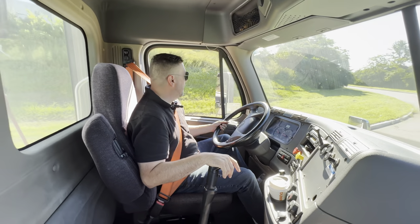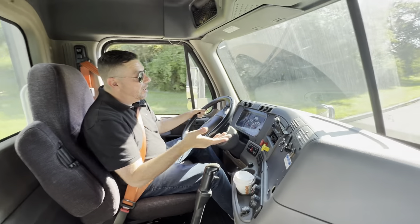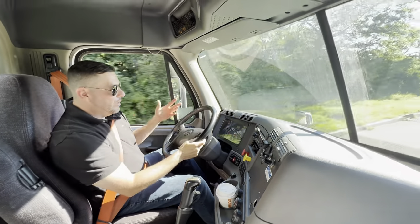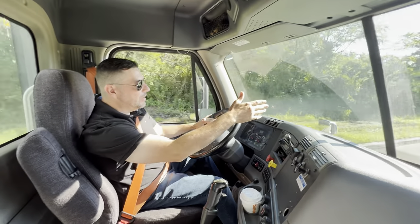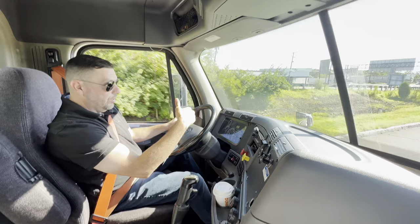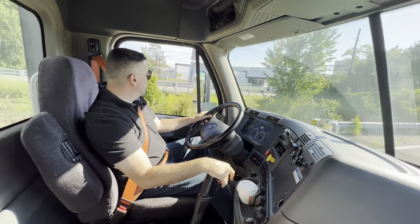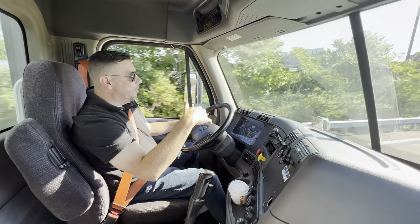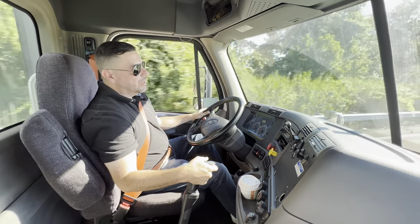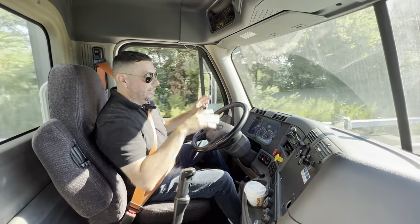Try to go to seventh. Let go of the gas. Clutch neutral. Clutch seventh — now I'm in seventh gear. Let's say I'm in seventh and the examiner says make a right here. I put my signal light on with time to let him know I'm going to make the turn. I start to slow down the RPMs. I want the RPMs around 10. Once they're at 10, I put it in neutral, I accelerate, and then I downshift to sixth.